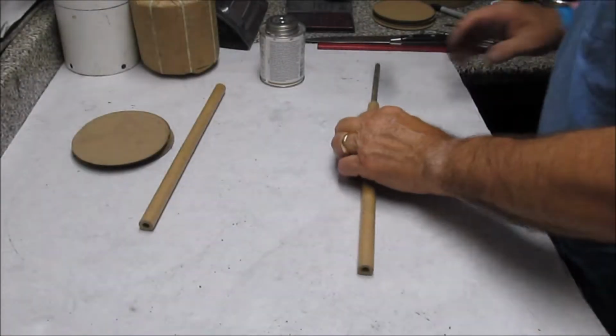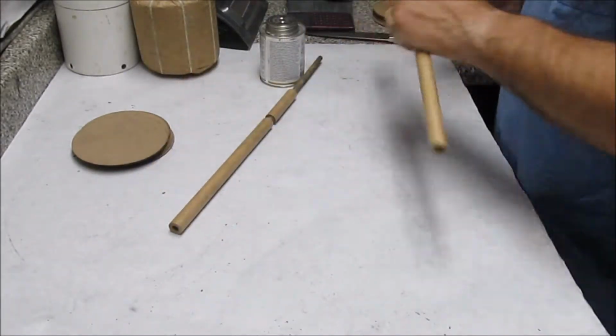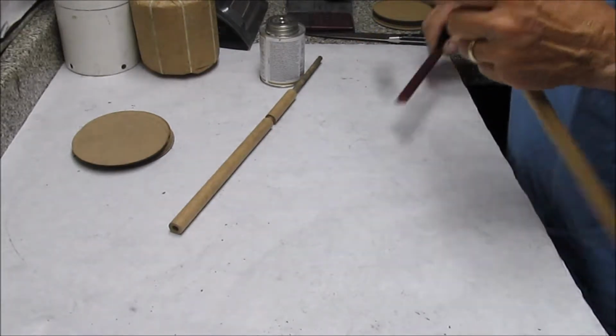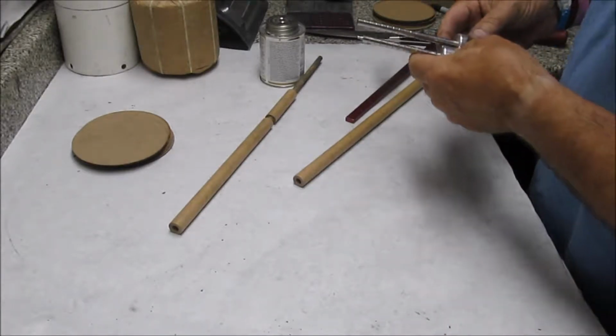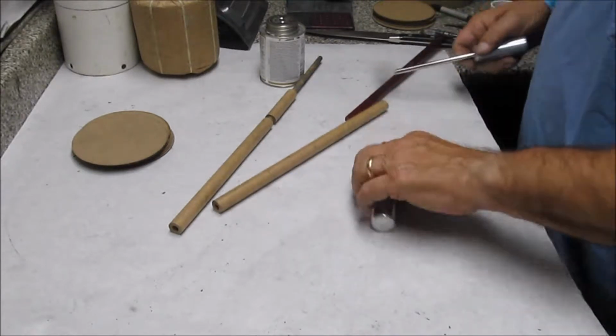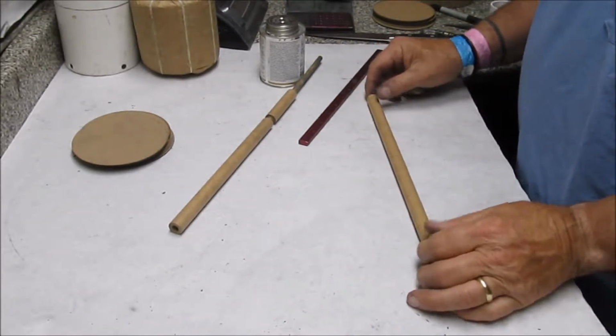For the Spolettes in this project, I'll be using these tubes from Caleb. They're 12 inches long, 5/8 inch OD, 5/16 ID. I have some nice tooling that fits snugly inside these tubes. I'm going to be cutting the Spolette tubes 3 inches long.